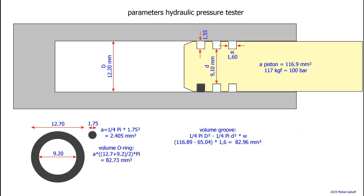I have little experience with hydraulics, so I try to determine as much as possible by measurement. For example, how much pressure can a simple O-ring withstand? At what pressure does it start to leak? And is it even a usable seal for this purpose? So I first make a small test setup in which I use one, two or three O-rings at will. The depth and width of a groove is precisely matched with the dimensions of the O-ring.